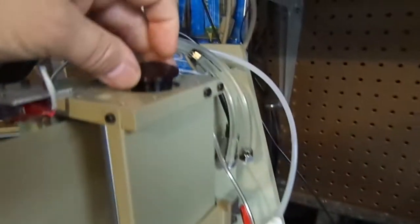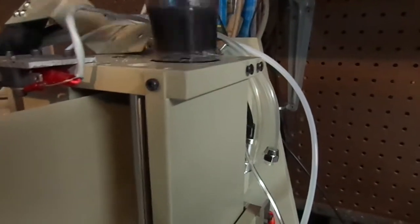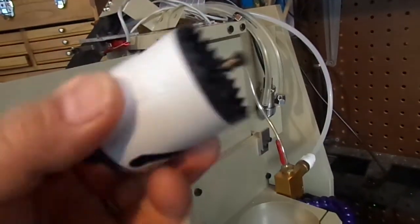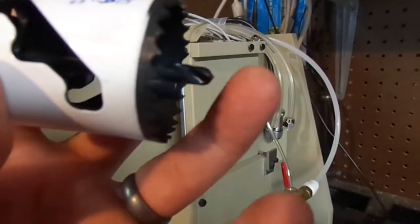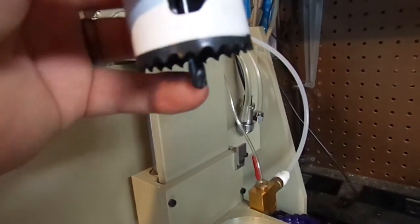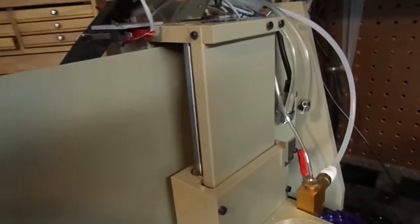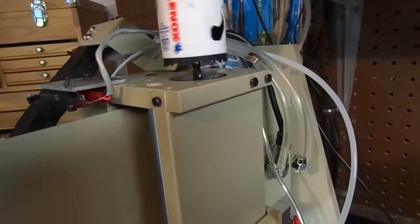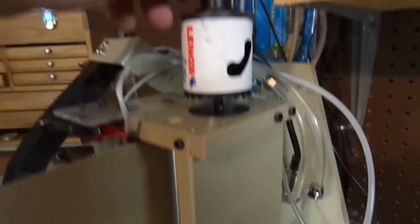The little guide bushing taps in and fits really tight. There's just enough room on the inside for the drill bit from the hole saw. When I cut this I'm probably going to exchange the drill bit shaft out of the hole saw for a solid pin so the flutes of the drill don't try to walk sideways. I haven't cut the pilot hole yet — it's 3D printed but not final size — but basically this is what we're going to have.